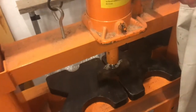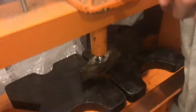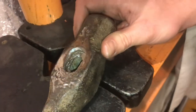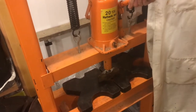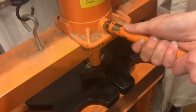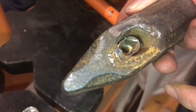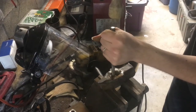I think it's working — I heard a pop and it looks like it's pushed down a little bit farther, so I'll release the pressure. It popped and this side is out farther. That milled slot was pretty much guesswork but it's almost exactly the right size. I'll try to press it all the way out. The press takes us as far as it can, then just a little hammering and — wow, it came right out! We destroyed the socket but it was already stripped, so good for a good cause. Now I'll drive out the socket, which should be a lot easier.